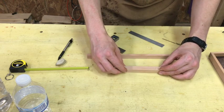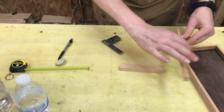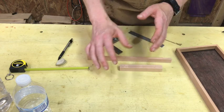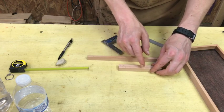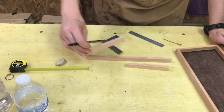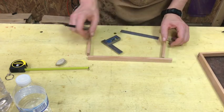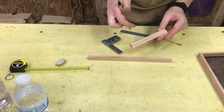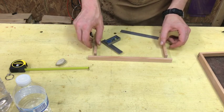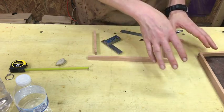And that way we only have to move the spacer once to cut. And if we are off a little bit, it won't matter because they will still line up perfectly with each other. It's a really helpful tip to avoid having to deal with being a fraction of a 16th off one way or the other if you try to cut these independently. So label them. We got a left and a right on the long one here. We've got a right and a left, and then on each one of these you're going to pick a side, left and right. It's a little complicated. I'm hoping this is coming across in words, and this will basically give us protection that if we're a little off on our cut, it still sits nicely in there and evenly.